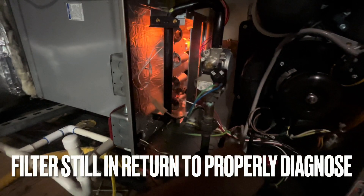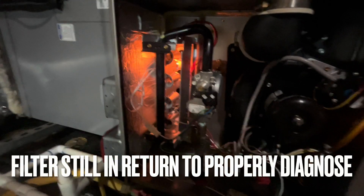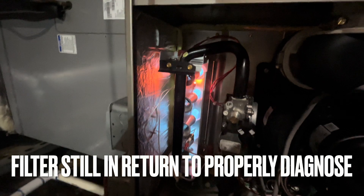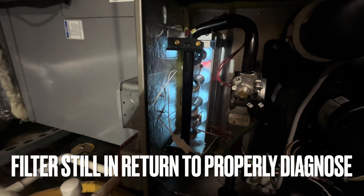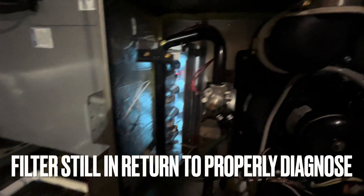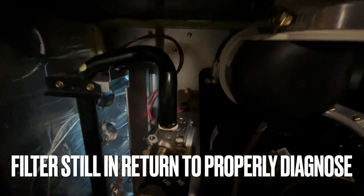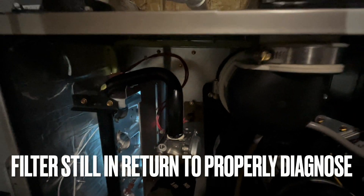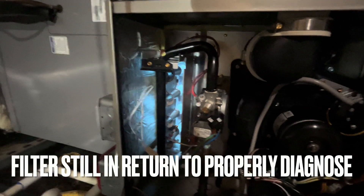With the 90% efficiency units, pressure switches will go off especially if these traps get clogged, so a vacuum always helps with that. Clean the flame sensor too. This limit is what's going to turn the system off at a certain temperature when you have a plugged filter. There are so many other things, but always check and change your filters. Sometimes insulation will fall too.